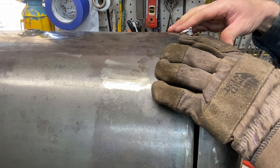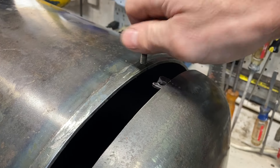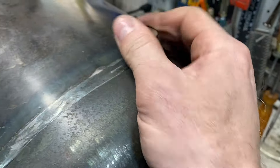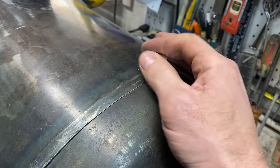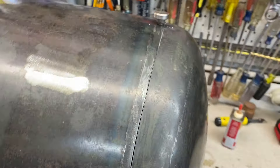We don't want to try to bend the pin — and it's funny because that's exactly what happened. With very little effort, the little stainless pin bent inside the detent mechanism and it was toast. I realized it needs to stand up to fairly robust use, so I came up with an even simpler plan. I've got a simple threaded knob here that threads into the hole so it doesn't get lost — you push the cover in place and engage it, and as it tightens down it secures it so it's not going anywhere.